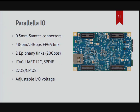In terms of, again, this is not the Raspberry Pi, this is not the BeagleBone, this is really meant for embedded processing with massive amounts of data coming into it from some kind of sensor. So with that respect, we made these connectors on there, not very hackable connectors, right? You can't really solder to these tiny ones, but you can bring in a ton of data. So you got 48 GPIO signals or 24 LVDS pairs for hooking up to things like high-speed DACs, ADCs, RFICs.